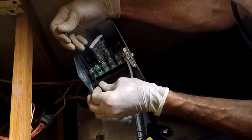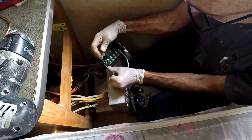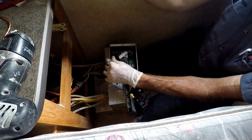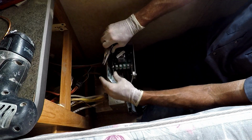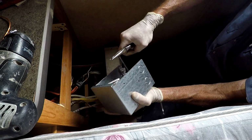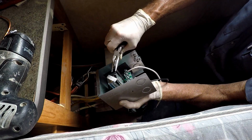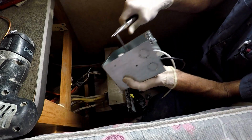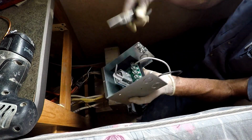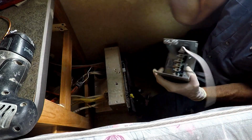Putting these on, do make sure you're not hitting the insulation with them. You'd be surprised how many times I've done it, and the factory has done it. So you clamp down on insulation, and you have a really bad connection, and then you have really bad heat, and then stuff starts to melt. And then stuff gets loose, which makes a bad connection. Repeat and repeat.